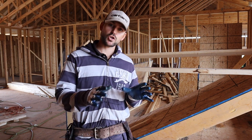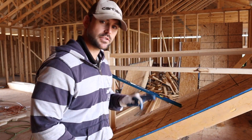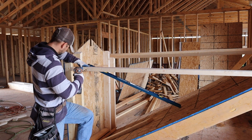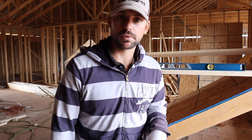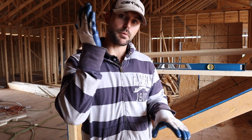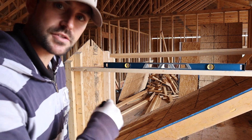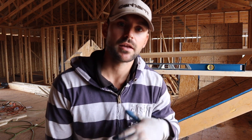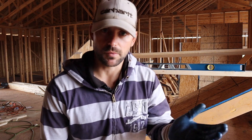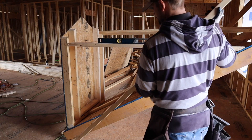Now we're going to secure that top plate on this wall temporarily with some screws — I've got my rigid impact driver here. Now we've got to do the bottom plate next. We're going to put a 30-degree bevel on this side on the bottom side, then lay it up where it goes and scribe where it's going to hit the upper part of the wall. To be clear, your bevel depends on the pitch of your roof — this is a 7/12 and it takes a 30-degree bevel, so if you're doing a 5/12 it's going to be different.